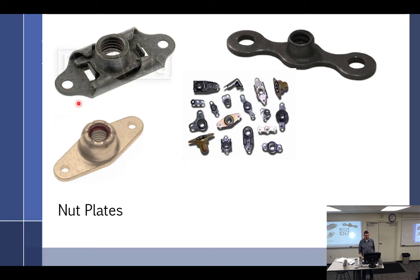So how do you fix that? You've got to replace them. And it's painted. The airplane's painted. The top left one, that centerpiece comes out, right? We had a couple where they did that. It slides back and forth in case you have a misalignment. It lines it back up, but yes, it does slide, and there's only a little metal spring tab right there that holds it in place. So there's all different types. This particular one right here is also a self-locking mechanism. It is crimped on both ends. I think I told some of you guys a story about how I had an airplane with a whole bunch of these on.